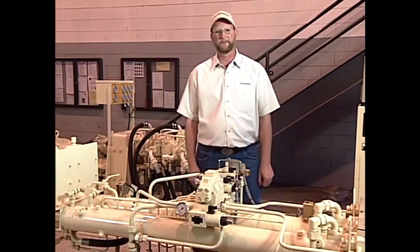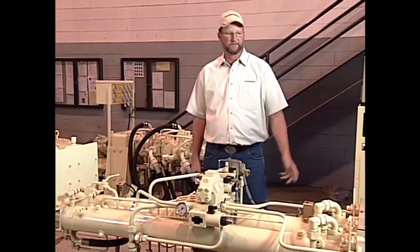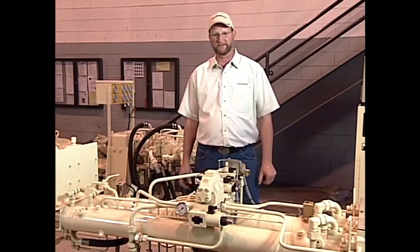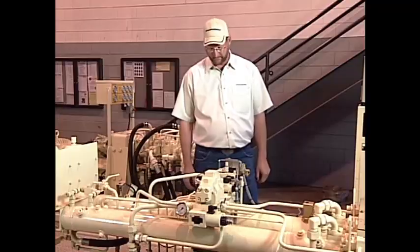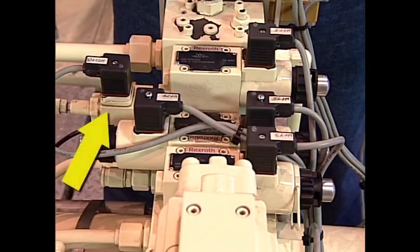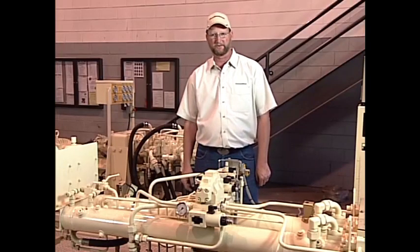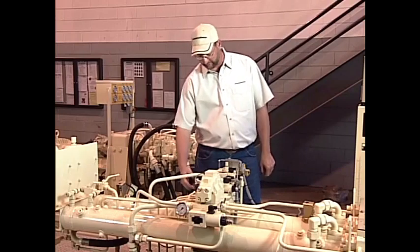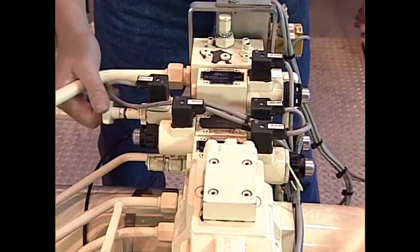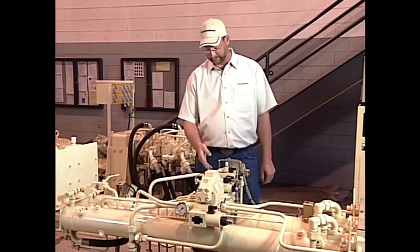When we want to reverse our pump, we simply turn on our reversing valve. All this does is change the timing for the S-tube and the main pumps to draw concrete back in the pipeline system. To efficiently control our pumping speed, we have our volume control located here beneath the POH valve. We control our volume with an electrical impulse for variable flow from dead slow pumping to wide open. We also have a manual valve located at the back of the valve, so we have complete control over our pump speed, either electrically or hydraulically.